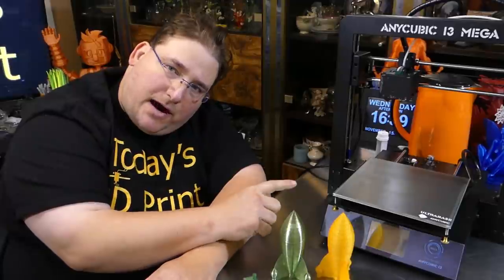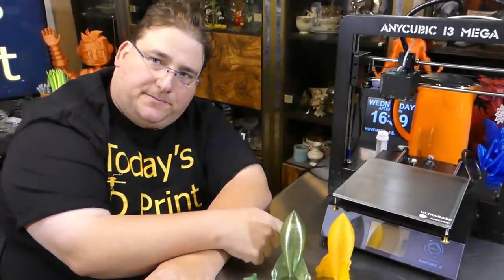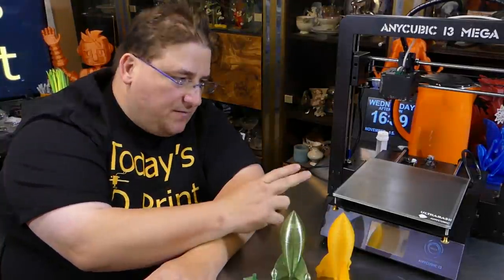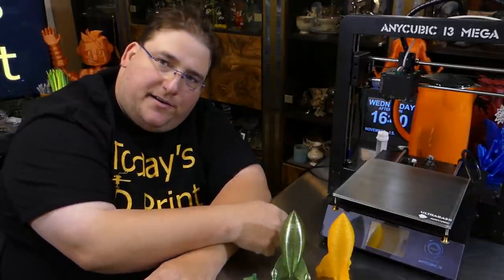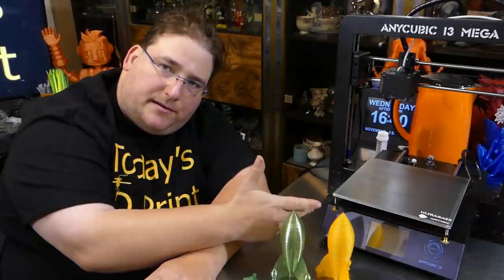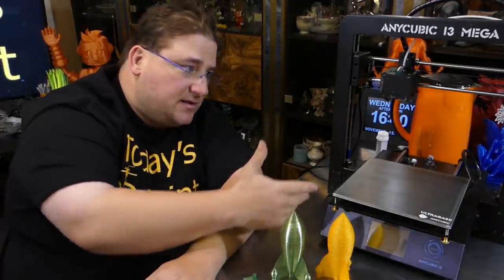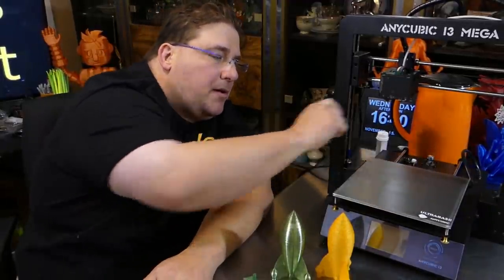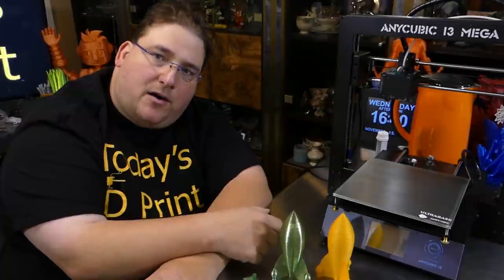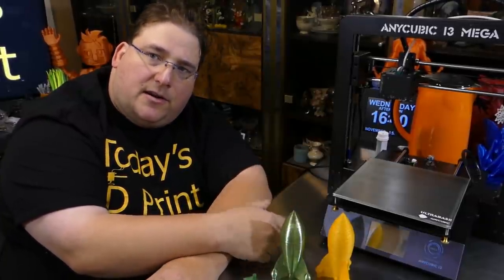The problem is: when the power goes out, the bed turns off, and the self-releasing nature of this print bed happens when the bed cools. If the power is off long enough for the bed to cool and you're not there to restart it, the print will release from the print bed and the resume function won't work because the part will have moved. For ultra-complicated models, what might help is using a hot glue gun to put three small dabs of hot glue to affix the model to the print bed in case of a power-off scenario. Don't depend on the power-off resume.